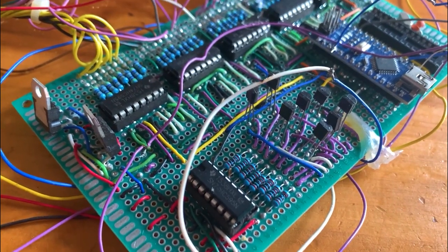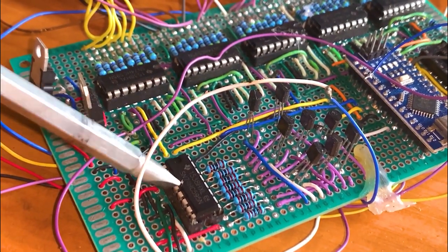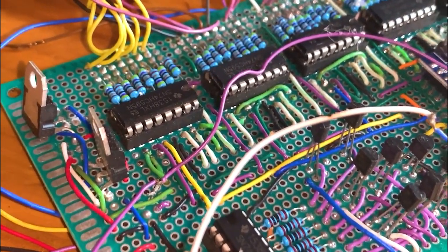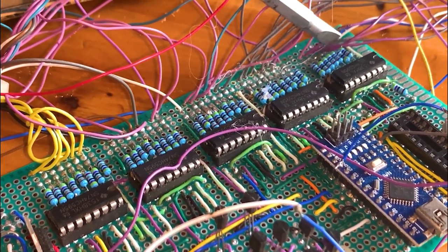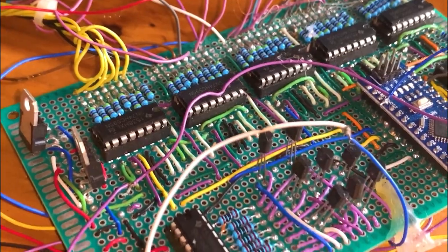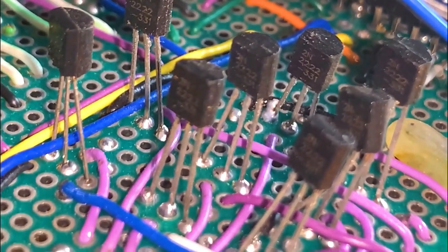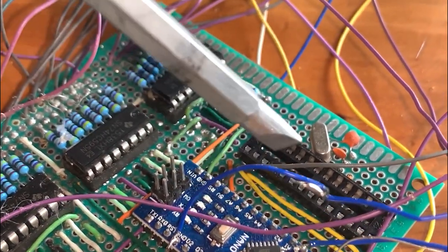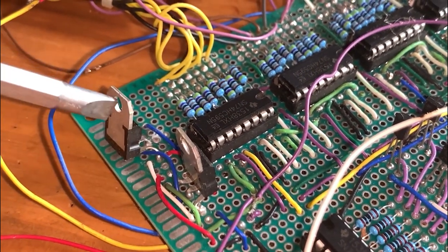The PCB already soldered is made of a combination of electronic components such as a microcontroller, which is the brain of the whole system, registers and switching transistors. A single IC here with these transistors is for controlling rows, and the combination of five registers are for columns control. I added an extra microcontroller with two high power switching transistors that would flash the round LEDs, as it was a requisition from the client of this LED matrix.